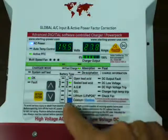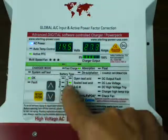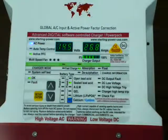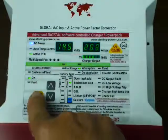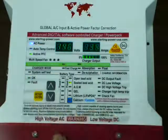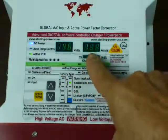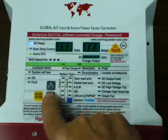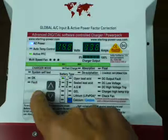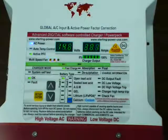We have the different battery types — there are 11 presets plus a custom that you can set for battery type. It defaults to sealed lead acid because that's a safe one; it's not going to do too much damage to any battery if the installer failed to reset it. We can change that by holding down the setup button for about six or seven seconds. It shows the absorption voltage and the float voltage for any particular setting. As we move through the settings, we'll see different results. We can lock that in, and we are now set for flooded.